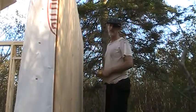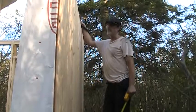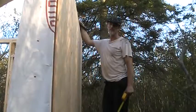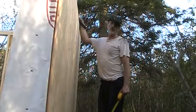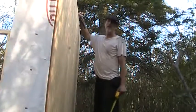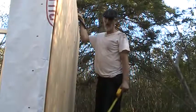Hello and welcome to my channel. We're continuing to work on our little chalet here. As the video goes on you'll be able to see around — I'm not going to stay in one spot the whole time. We completed the first floor framing, squared it all up, put some Tyvek on this end, some house wrap, and we've got our two pieces of sheathing on.